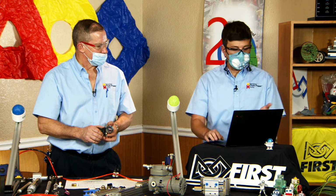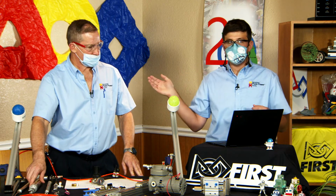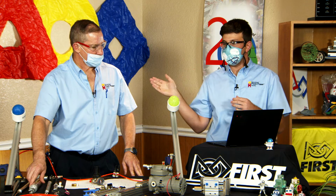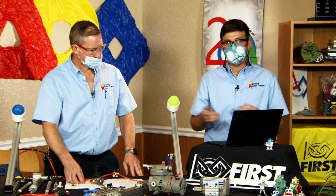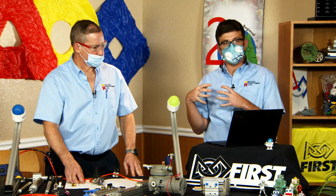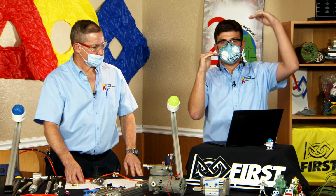Say, for instance, like that mission space example I showed earlier, when that door's closing, you don't want the door to start fast and then slow down. You want it to have one smooth cycle, moving at the same speed and force along the entire length. If you only had one pressure, as soon as it starts moving, that pressure is going to drop. So you have that stored pressure behind the working pressure to replenish it. That way your working pressure always stays at a steady 60 while your stored pressure dips and is then replenished by the compressor.